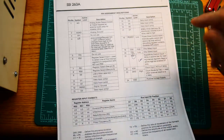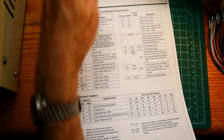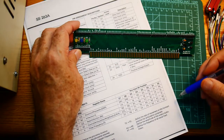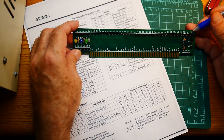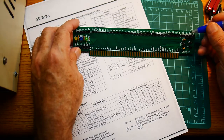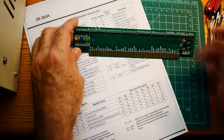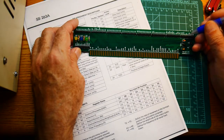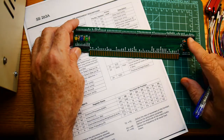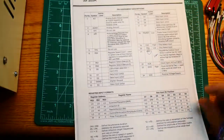We'll use the oscilloscope and we'll use my little card to go probe some signals. There is a clock pin on pin 49, and I'm going to look at that and see what speed that is and what levels those are. I think that's a TTL level clock — it's either 2 MHz or 1 MHz, we'll take a look. And then plus 5. So we should be able to hook this thing up.